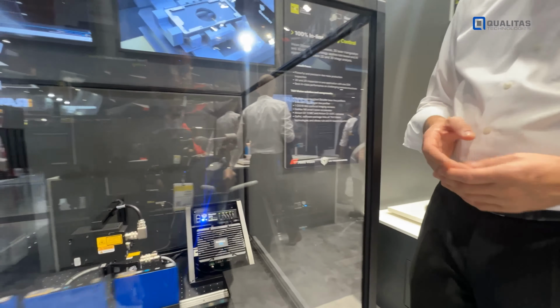Then next we do some confocal imaging inspection with sub-micron accuracy. Wow. So the electrodes on top, later you do some ultrasonic welding on top, so it must be really quite flat. If it's uneven, you have scratches, some pinholes, whatever, then it's not really good for the next welding process. So that's why we can look with our confocal sensor at very small defects.